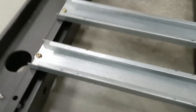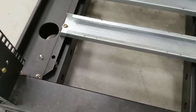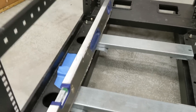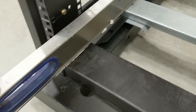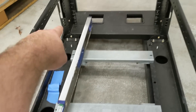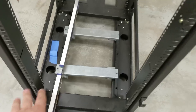There are two pieces of steel on the bottom that looked a little bit high. If I flip them I think that will make them sit just low enough so they're flush with the front and back support. I like the idea that this is completely flush now right across the surface from back all the way to the front. I scabbed on a couple of random pieces of steel that I had from scrap in my backyard, and I'm going to cut a big rectangle to go across the entire floor and sit down on it. These will support that piece of steel and I'll have a floor for the cabinet.